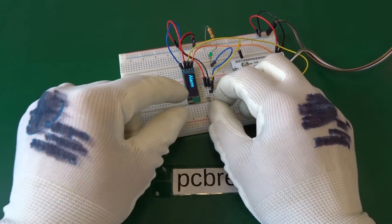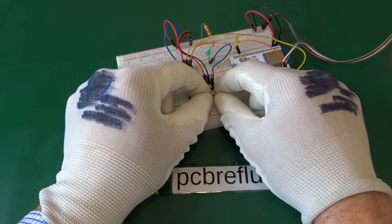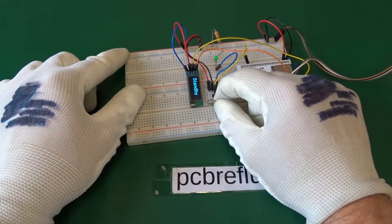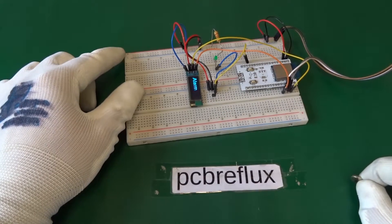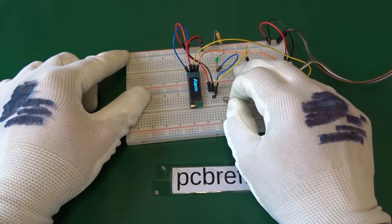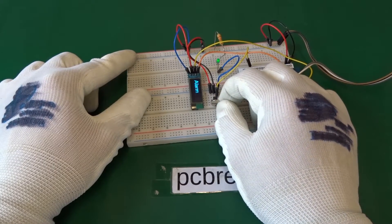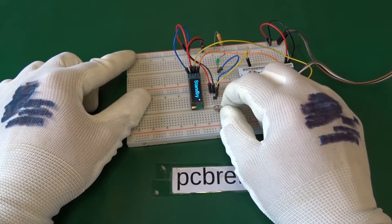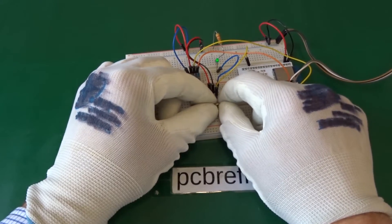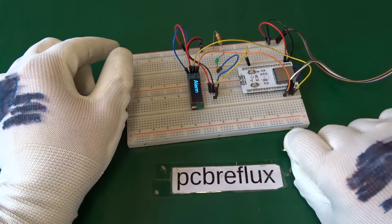On the ESP32 there runs a firmware with an interrupt, so each time the Hall Effect Switch changes position the alarm goes on and we can see the alarm sign on the display. To disarm the ESP32 we have to press the reset switch. The firmware can be used in two modes: if we approach with a magnetic field the alarm goes on, or if we have the magnetic field attached while in standby mode, then removing the magnetic field triggers the alarm.